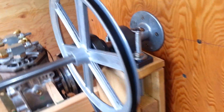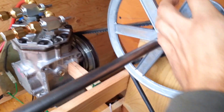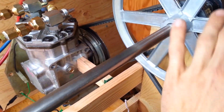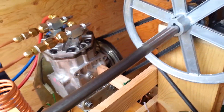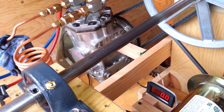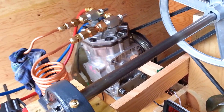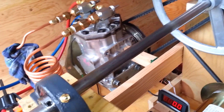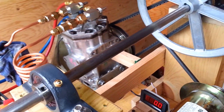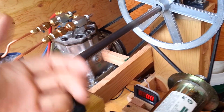I was always planning on making a flywheel, but before that I got a hold of a 10 inch pulley and a 1.75 inch pulley, and rigged up a system to gear it down to about 375 RPM max. Still didn't work — the belt slips, and I was even stalling the motor. The problem is that even though the average mechanical power consumption might be around 100 to 200 watts, almost all of that power is required at the moment of compression — two compressions per rotation. So it might need 100 joules in a tenth of a second at peak, even though average consumption is only about 100 watts.